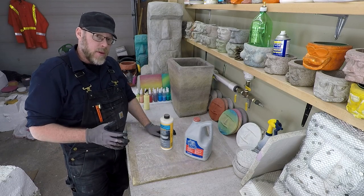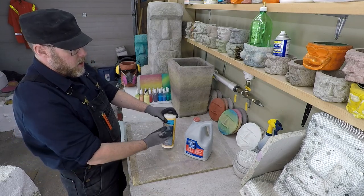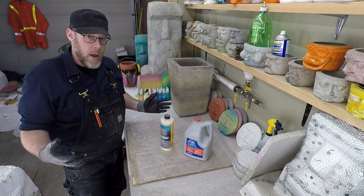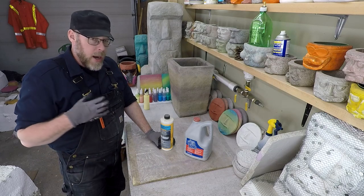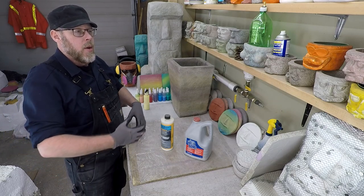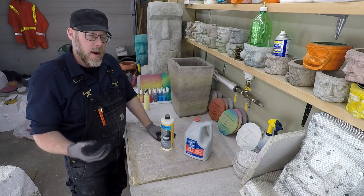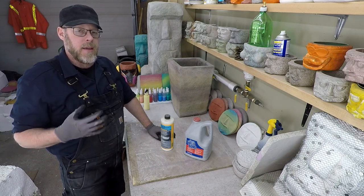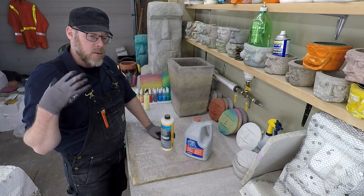There are a lot of different glues you could reach for, but I recommend going to something like one of these made-for-concrete applications. The reason is this: regular PVA will re-emulsify. We add it to the water, the concrete solidifies and it's hard — but when it gets wet again, when it's exposed to moisture again, that PVA component will re-emulsify and we lose its strength enhancement.